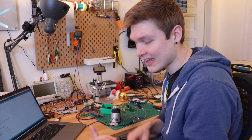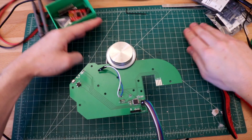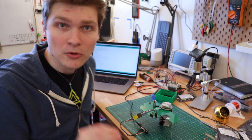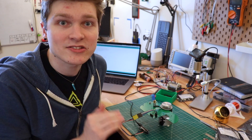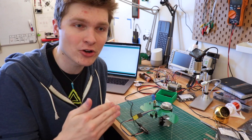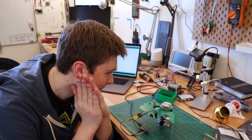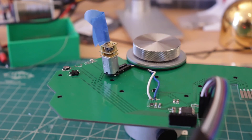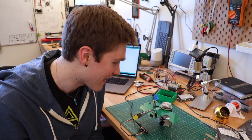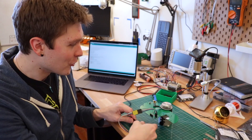Now I'm going to try messing around with all the other chips on the board like the motor driver and the optical sensor, and make sure those are working. Motor's hooked up — I wrote another quick sketch just to test the motor driver. The motor driver lets me control the motor at different speeds; I have two speeds in there, full throttle and a little bit over half. And up we go — this never gets old. This is that really, really tiny chip I showed you earlier. I was really worried I didn't solder that thing right — wow, this is such a relief.